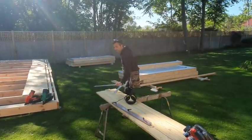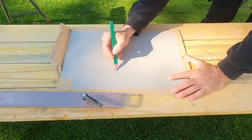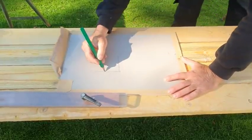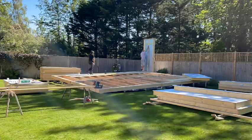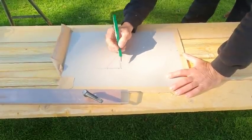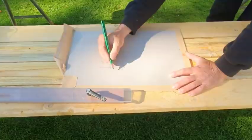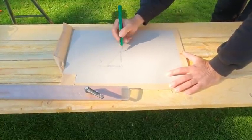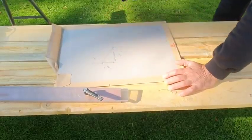I like to take the framing square. Let me try and draw this for you. So let's take our floor joist here - this is the end of our building. We're going to stand a panel up here and it's going to be so-and-so big. We're going to need a brace which attaches here temporarily and into the side of the joist to keep this plumb. We're also going to have a couple of boards through here to work on - I know they're 600 or two foot wide, so I need to allow 1,400 across the floor. Then I need to put this brace at a height which is comfortable to screw - too high and you've got to climb on something. I'll set that at around 2.1 metres. So this will be 2.1 metres and this will be 1.4 metres, and I can just do that straight off the square.